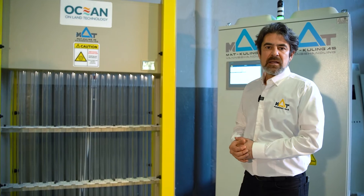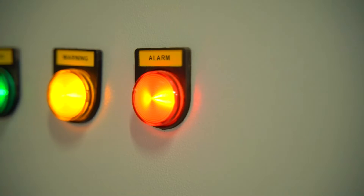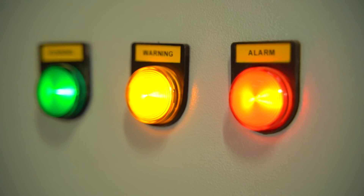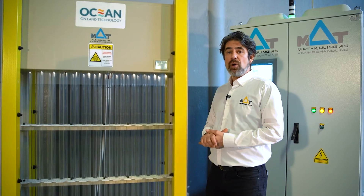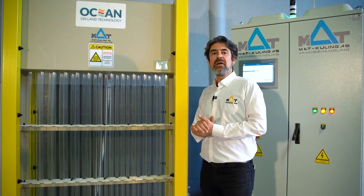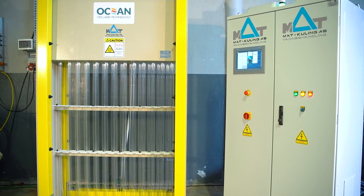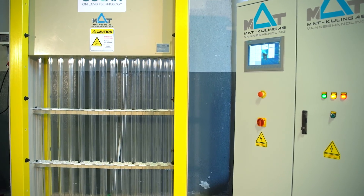Our channel type units are completely customized, so there is no upper limit. We can go up to 10,000, 20,000, or 50,000 cubic meters per hour, and we can apply every dosing grade — 40, 50, or 60 millijoules — depending on which water we need to process, like drinking water, fish farms, or other applications.